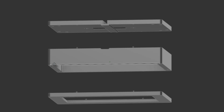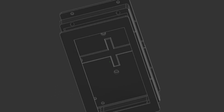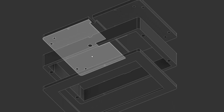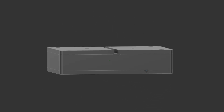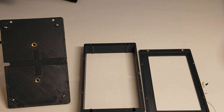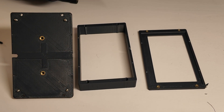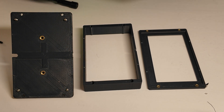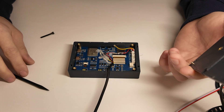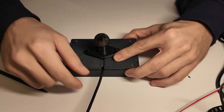With the wires connected, I used hot glue to attach them to the board to prevent any movement or pull-out. It does look like a mommy blogger's craft project, but I'm okay with that. My next step was to hop into Fusion 360 and design a case to protect and mount it. I went with a three-piece design, making the back with a hole so wires could be routed without redoing the connector. After a bunch of test prints due to ASA shrinking and tolerances, I finally have a working case.